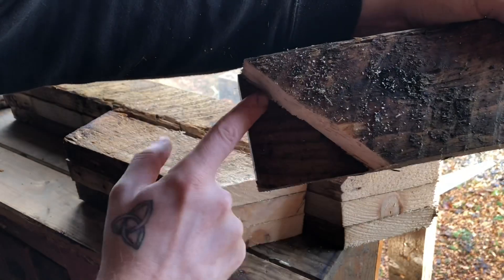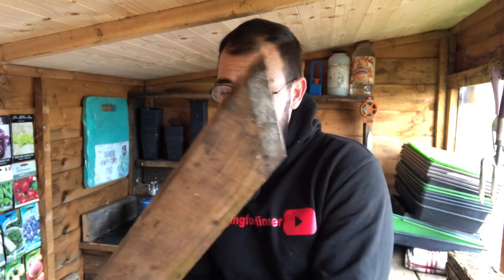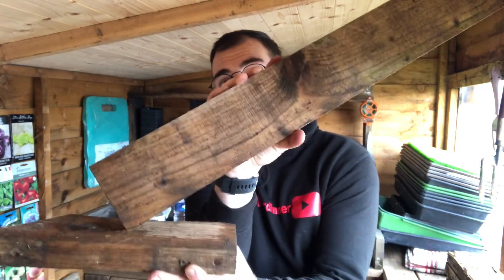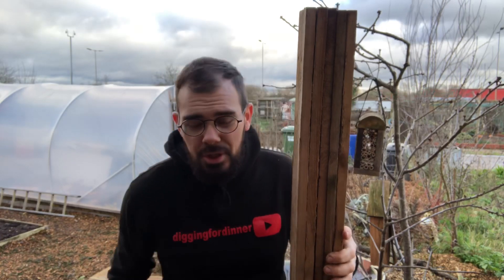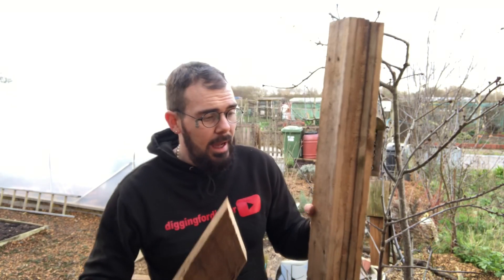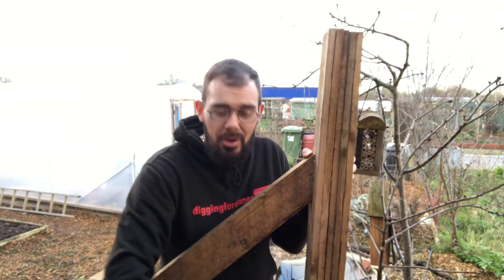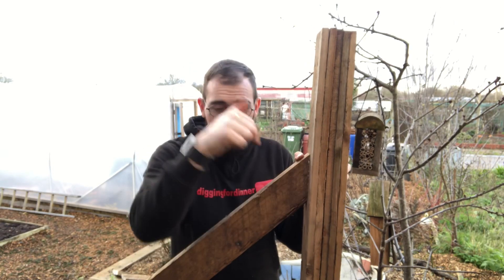The reason we do this is that once this half is fitted to your post, the bottom half won't be sitting flat on the floor — instead it'll be sitting nice and flush. These are the final cuts before we actually put this thing together. We come back to our post of wood, grab one of our longer lengths with the 45-degree angle, and we basically just want to butt that up against it. Use level ground if you've got it — I'm on wood chip, which isn't ideal — but you basically just want to line it up, butted down on the ground.